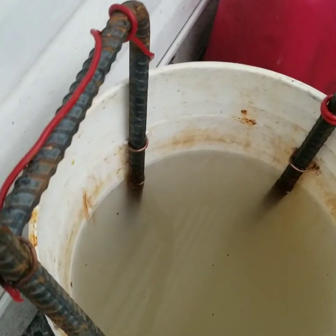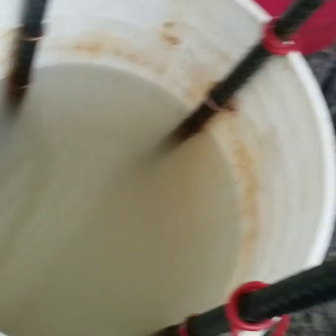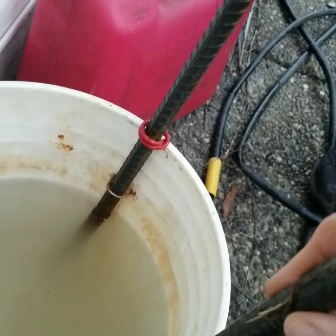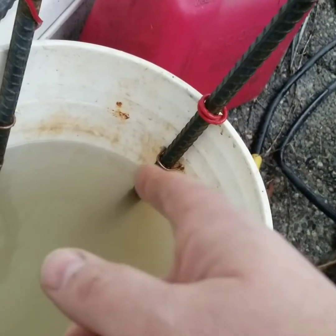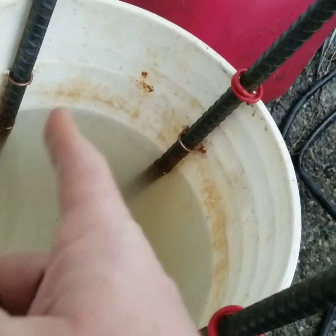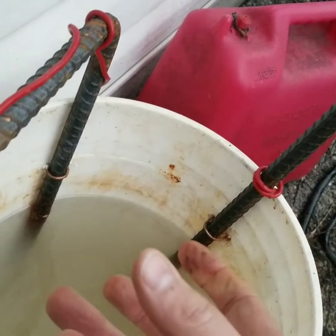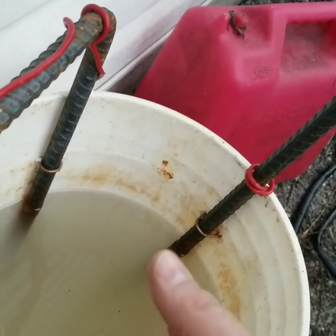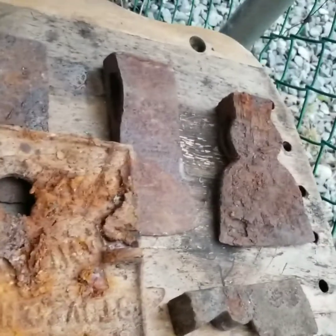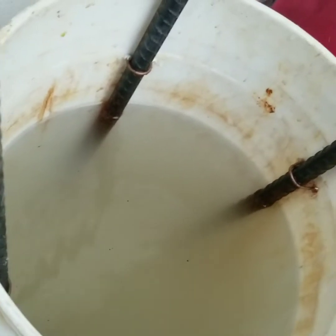You don't want copper touching the water, because it will create a really toxic green crap that's not good for you to touch. The copper is mounted outside — drilled holes through the bucket — so it stays out of the water. Whatever metal you're going to use has to hang independently in the water without touching these iron rods. The negative goes to whatever you're electrolysing, and the positive goes to these iron rods. The rust is supposed to leave the gun or the plate and attach itself to the iron poles.